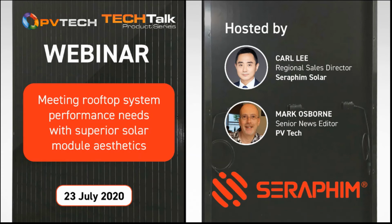I think definitely for sure that we still need the microinverter or the optimizer, because no matter the half-cut cell or the cell interconnect technology, it can hardly replace the function of the microinverter or the optimizer. Reducing the shade impact is just one benefit that this tool can bring to customers. Like a very big brand of optimizer, they have at least three or four different function choices, like optimization, fire safety and monitoring. Like the point we discussed in my presentation, rapid shutdown is one example that currently cannot be achieved through the module itself.